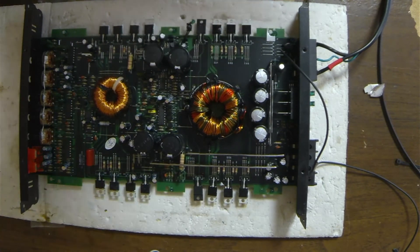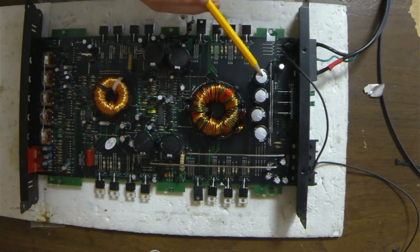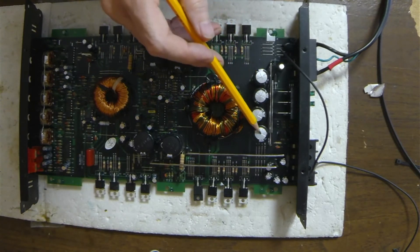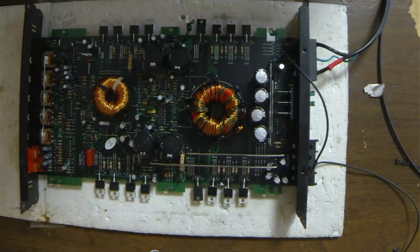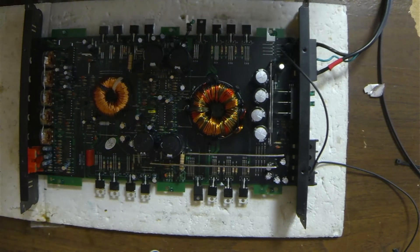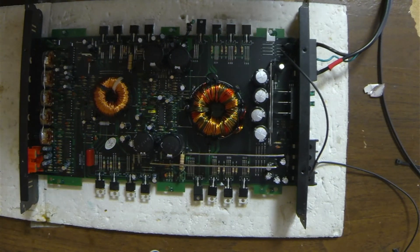The last thing I'll do off camera is verify the capacitor, because it does look like there's a little bit of a bulge on the top, probably from when the negative terminal was separating from the PCB. Otherwise, that concludes this board. I do thank you for watching. Please like and subscribe if you're interested in amplifier repair content. I'll be out again soon with the next one.